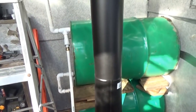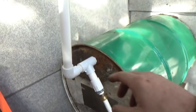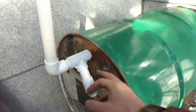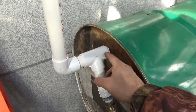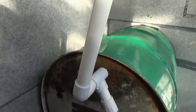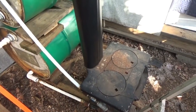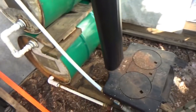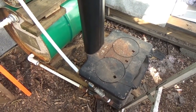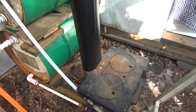I got the stove connected and the pipes connected. I had a little issue - the PEX didn't want to flex and it turned my fitting, which was perfectly straight and beautiful. It's permanent now. When I put on the PEX, this fitting wasn't perfectly cured yet and the PEX put enough pressure to twist it - so it's not straight. There's nothing I can do about that. I have a complete and fully enclosed system so I'm letting that cure. Meanwhile I'm working on the stove pipe. The stove pipe is upside down - this is an antique stove, maybe they had different pipes back then.